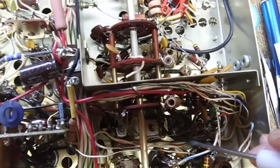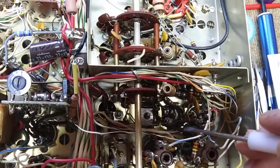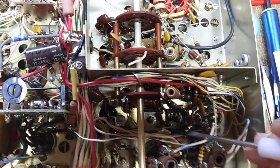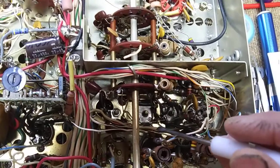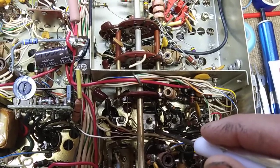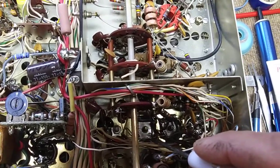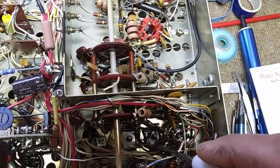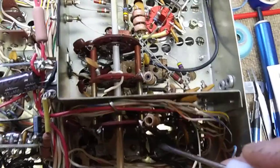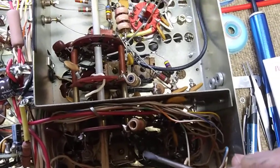The TR3 was absolutely plagued with leaking like that and short circuits against the chassis where the cloth braid insulated wire was pressed against the chassis and against these sharp terminals, these spring retention features on these transformer cans. I found about 6 places in the TR3 where there was arcing like that, and the answer is to separate the leads. If the wire is insulated by that cloth braid, move it away from the chassis, and realize that cloth braid is not electrical insulation, it's full of holes. So beware of that, because that can cause a lot of intermittent operation that's really, really hard to find.